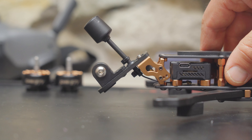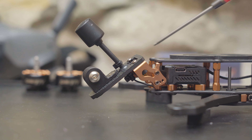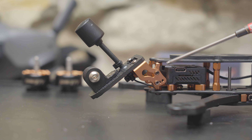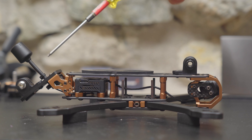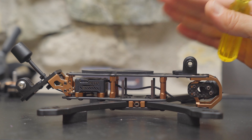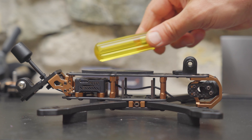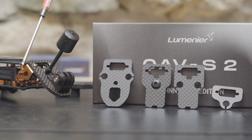Another big innovation with this drone is this rear assembly — probably the sexiest back end you'll ever see on an FPV drone. It's made up of four aluminum pieces and the captured XT60 connector, with two standoffs and two side plates giving you three tilt options. When I first saw this I wasn't quite sure about putting the XT60 on the actual rear plate, but after having the frame together it makes a lot of sense — a front XT60 will interfere with the GoPro when you tilt it back, and a rear XT60 will interfere with your battery mounting space. By putting the XT60 back here on the rear assembly you have tons of space for mounting a battery.